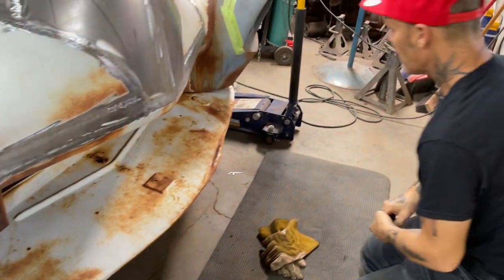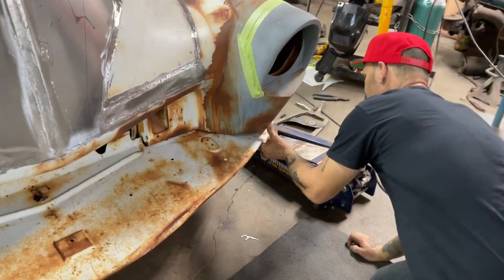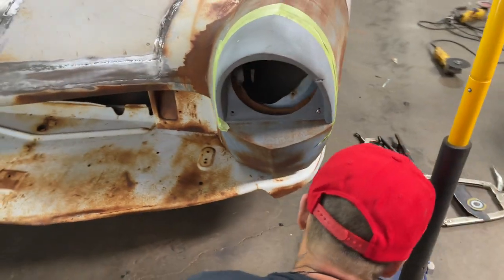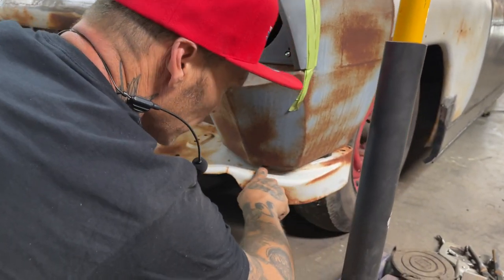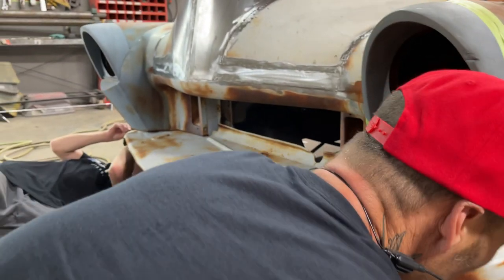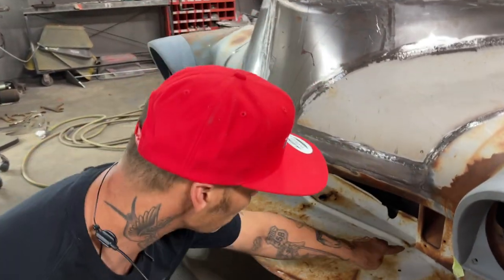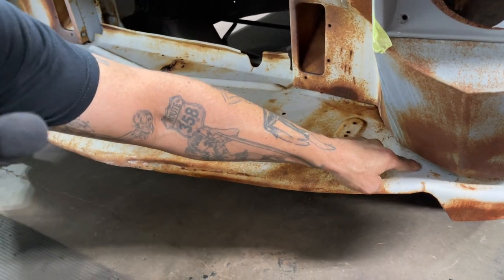Awesome. So now, if I have this piece on, I'm thinking the original bumper might not go on. It might not. I'm not sure if the original bumper goes on this body line here, or if it just comes on the face of this. I have no idea yet. But we're going to have to find out before we can start plugging it on. If we bolt it all on, then we can weld it all the way across here, weld it all the way in through here.